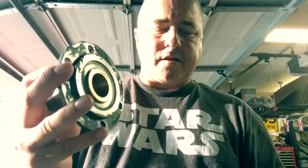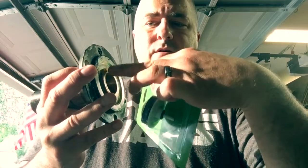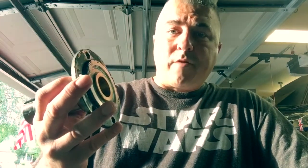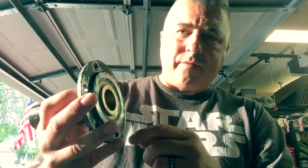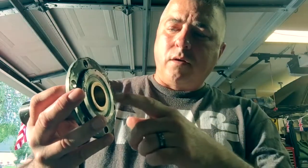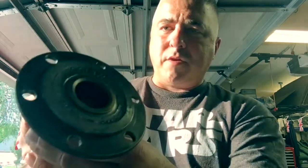So what we're going to try and do is waller out the inside part of that bushing using a couple of things. I've got a blade sharpener from Ace Hardware — it's got a stone with a beveled edge that we're going to try to put right on there and take away a little bit of this material. Then I'm going to use a cylinder hone for a wheel cylinder to help round things off. Now you could just simply remove the bushing and get the proper bushing pressed in, but to get it out you'd have to destroy it and I don't have those tools. So we're going to go ahead and cut away at this inner edge a little bit to try to mimic this bevel.